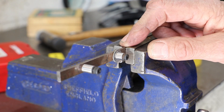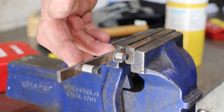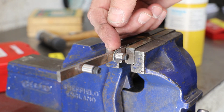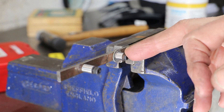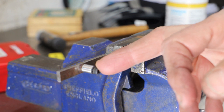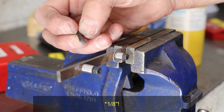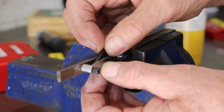To solder the parts together I've made a little jig using a bit of 3mm bar. I've drilled and tapped two holes at M4 the right distance apart, which is 54mm. We can see I've got the bush screwed in at one end with a washer to offset it from the bar, and then a longer bush at the other end — a 6.4mm bush at the far end and a 9.6mm bush at the near end. To ensure the main body sits correctly with respect to the two bushes, I've got some 3.2mm bar which I'll clamp behind the bracket to hold it in the correct place.